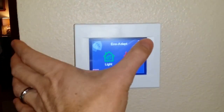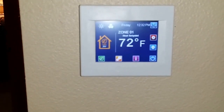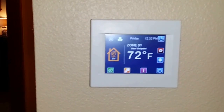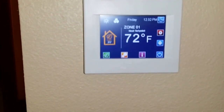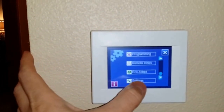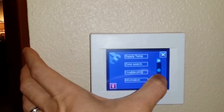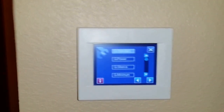You have different kinds of economy modes: real heavy economy, light economy, or off — that's where it uses logic to be as efficient as possible. You can also weight zones, so for instance one zone carries the majority of the load, while a bedroom that runs cold gets a heavier weight. There's also the adaptive airflow feature: if all zones are calling you want one airflow level, if only three zones are calling you set something else — that's called the Q Adapt feature, with power mode, standard, silence, and absolute minimum airflow settings.